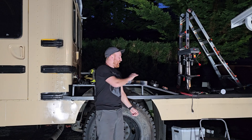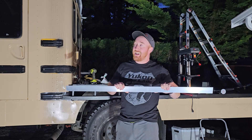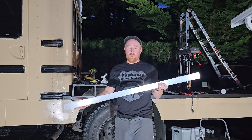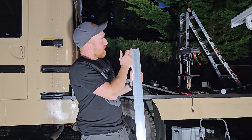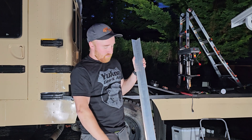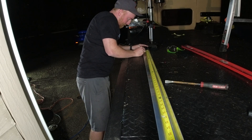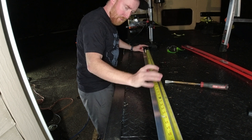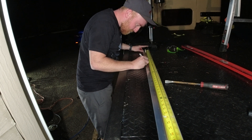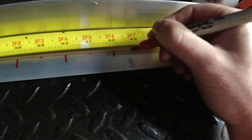Tonight we're going to be talking about the solar panel mounting to those strut channels already mounted to the roof. The brackets are aluminum, which is going to make it a little bit easier to drill, easier to cut, and also a little bit lighter up on the roof. This is a four foot section. Before I cut it I'm going to mark down the center line where I need to drill holes later. I'll mark every one inch with little dots and every two inches with a long stripe — I'll cut on the two inch marks and drill holes on the one inch marks.